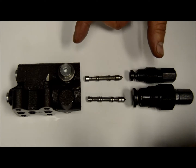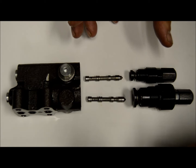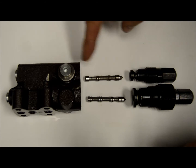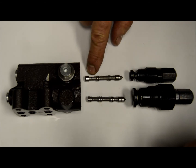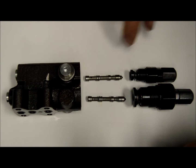So that's an easy way to tell if you have either a standard DFR, DR type of control, or if you do have a remote type of control, if your unit doesn't have a tag or you're not sure. All you really have to do is take apart this top spool, check the tip and the orifice — if it runs all the way down, clean that out and make sure it's cleared. But that's an easy way to tell what type of control you have.